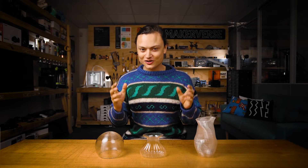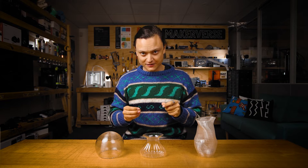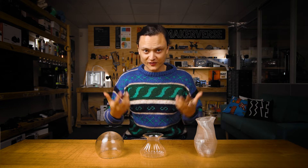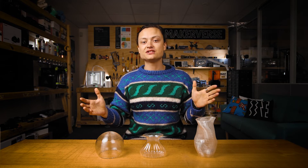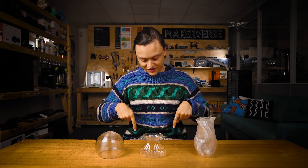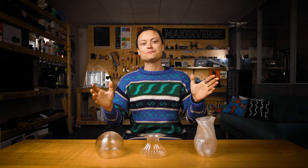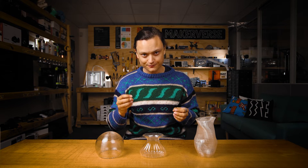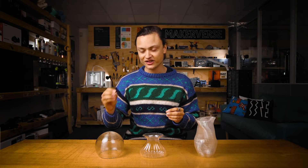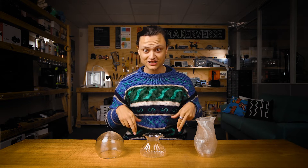Best results will come when you're creating already good 3D prints that are already very transparent, as they will enable this process to occur most effectively. I dive into the process to get this done in a previous video — link in the description below. Big shout out to the 3D Print General for enabling me to discover this idea of using PVB material and post-processing it in this manner. It is remarkable the transparency change that has occurred over the stages — link below also for his videos on this topic.